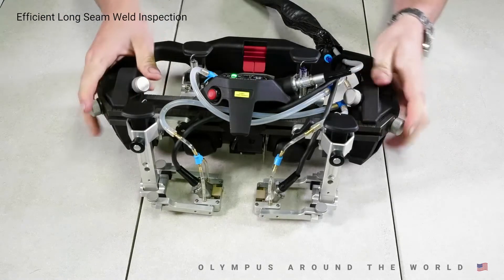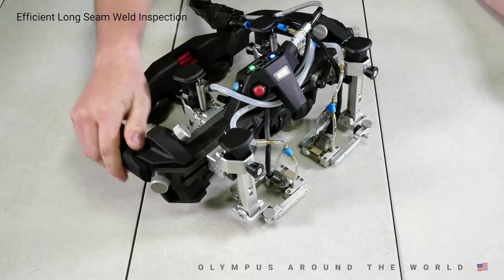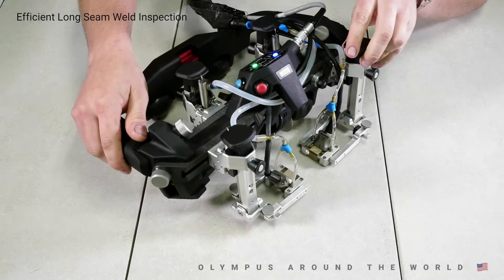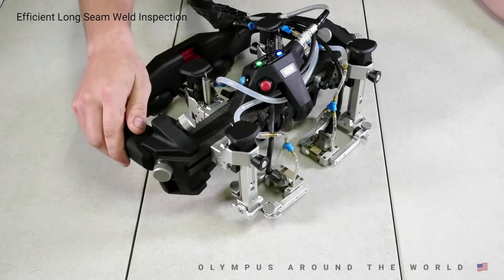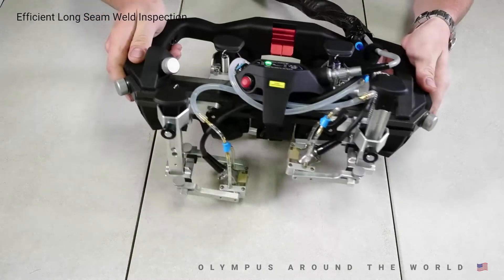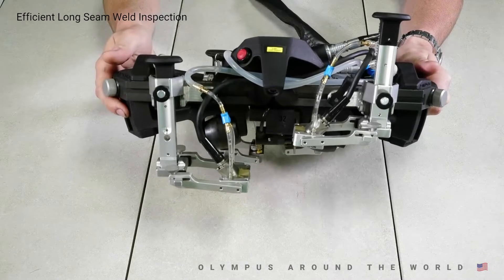In my experience, the weakest point on any scanner is the probe holders. Probe lift-off is the biggest headache for any encoded inspection, as well as probe skewing, which reduces the probability of detection. The redesigned probe holders have the user in mind with a stiff pivoting system, pressure adjustment with user-replaceable springs, and a latching system to hold the probe in the upwards position — keeping the probe safe during handling and adjustments. Probe index offset adjustments are done using a quarter-turn quick positioning lever, making adapting to various thickness welds easier than ever.